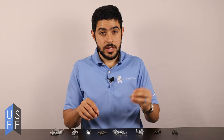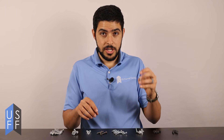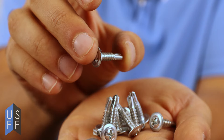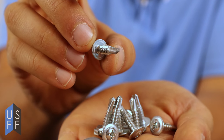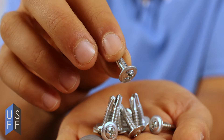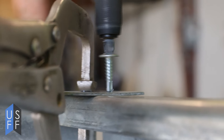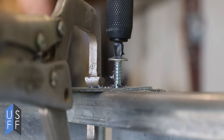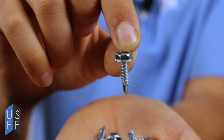If you're doing structural work like exterior load bearing walls or interior load bearing walls, then you really want to be looking for something like this. This is a modified truss head screw — a typical framing screw about three-quarter inches long with a self-drilling head. It's really great for getting all the way through double-layer 14 gauge, which is extremely important. There are also these hex heads.